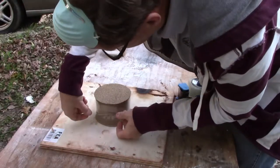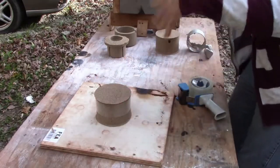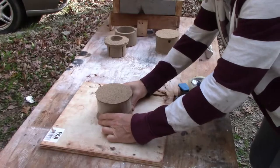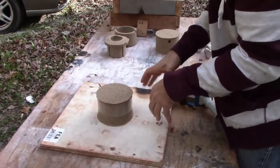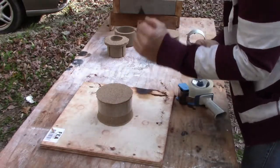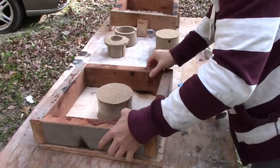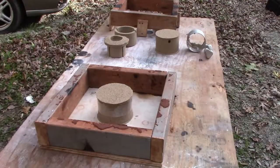That's number one thing, because these patterns, I 3D printed this pattern stuff, and then I made an inverse mold. Probably give you a zoom in on that. So basically what we'll do here is we're going to fill this with gravelly stuff, and then we're going to put our risers on the side. So we'll put this on here like this. Get my tape out of here so I don't ruin it.